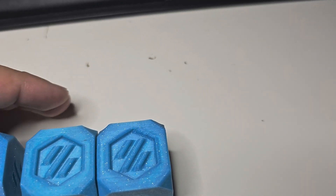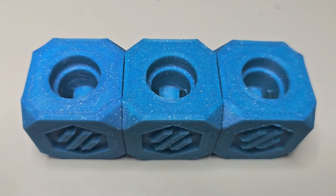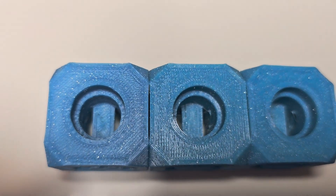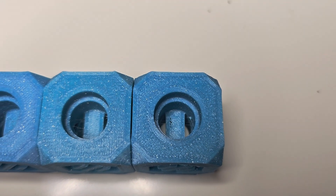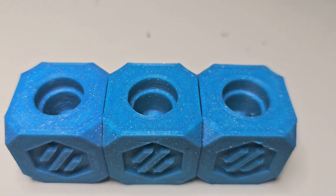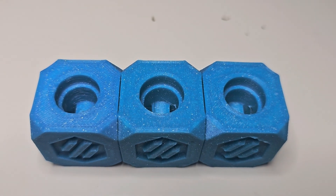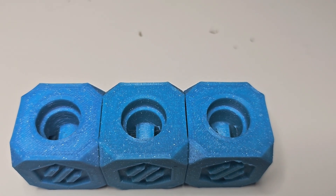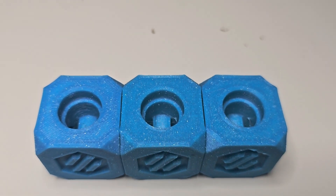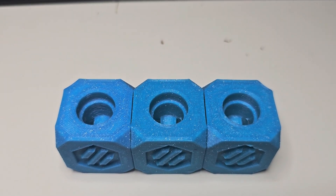Finally, let's look at the top layers. The bridging in the middle looks pretty good on all three — maybe a little less so on the faster print, but still not bad. The top surface layer is fairly evenly applied with not too many artifacts. The edges of the bore — the circle hole — look nice and crisp on all three. I'm happy with the results. Maybe a bit of extra tuning can help, or maybe I need to scale back speeds a little for quality prints where I want the sharpest detail.